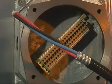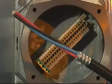Cable preparation. Allow sufficient length of cable to enable termination of the conductors into the junction box. Strip back and remove the required amount of outer cable sheath and corrugated armour to expose the inner conductors. Ensure all cable fillers are removed.